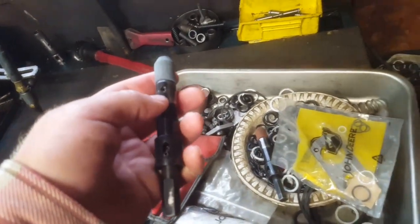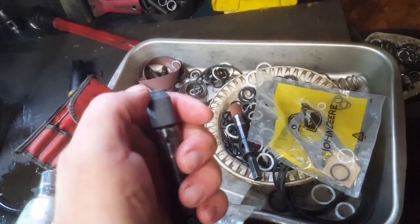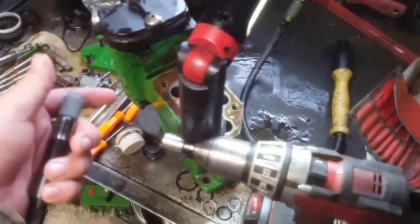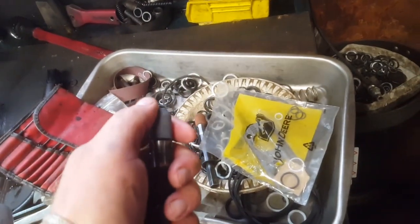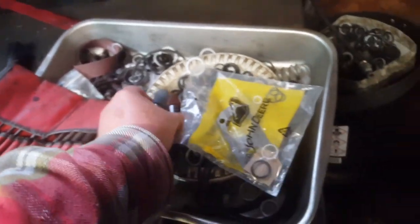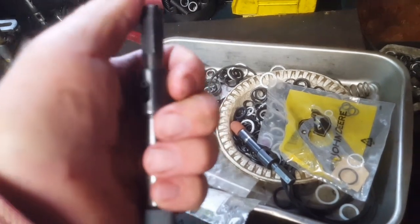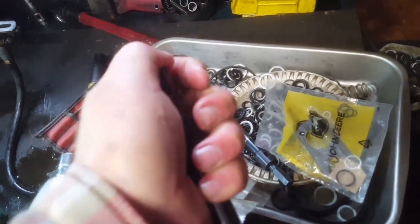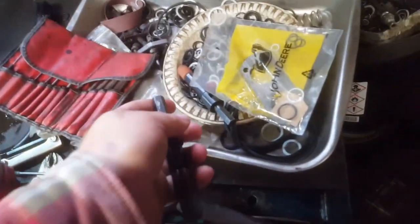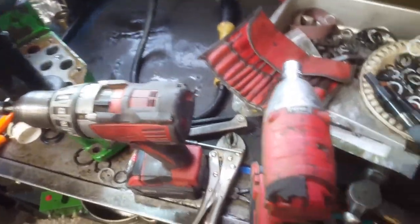This is a service tool from John Deere. You're not just going to find these on Amazon. Maybe nowadays, I take that back. Maybe nowadays you could find these on Amazon. If you feel that your valve needs a hone job, you may be better off just to take it in to a Deere and have them do it. You got a coarse and a fine. They are spring loaded on the end. You can see how it's trailing. It's a stiff bugger spring to move, and you're not gonna push down. We literally just touch it, check it, touch it, check it.